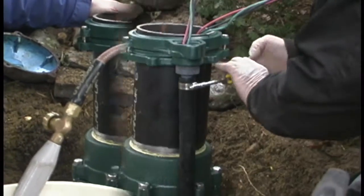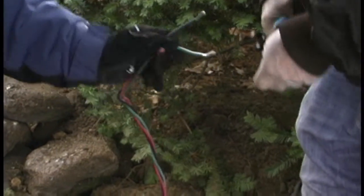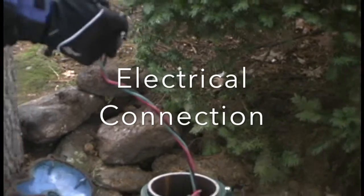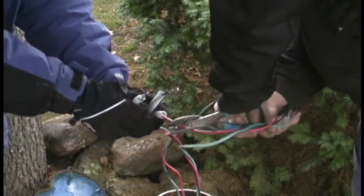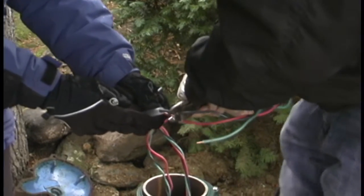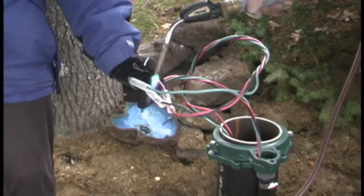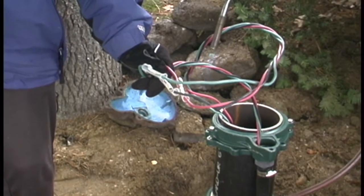Now we have the extension casing nice and plumb. We're going to make sure too that the cap is plumb so it doesn't look odd. We use hose clamps and we clamp that to the nipple. Now we're going to make the connection from the pump wire coming up to the house wire. Again we put on our silver connecting pieces — compression. We add on the silicone tubes and always do that first, because many times we've forgotten to put them on and have to re-cut the wire again. You always want to check the wires that they did clamp on properly so you're doing a good pull. And again, shrink the silicone tubing right on.